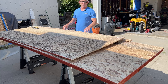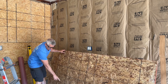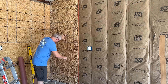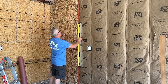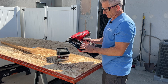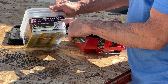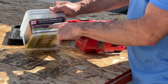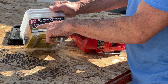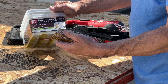Now we can pick it up and bring it into the garage and get it installed. The factory edge is pulled up and the cut edge is on the bottom. I've got my level here — I'm going to make sure it's plumb. Looks good. I'm going to use my Milwaukee 20-to-22 degree framing nailer with Grip-Rite collated framing nails — plastic strip round head, 2 inch by 0.113 inch ring shank. I have half-inch sheathing, so I get an inch and a half of penetration, which is plenty.